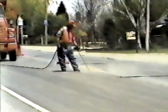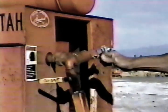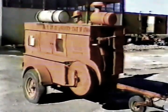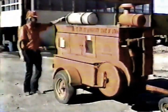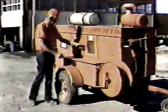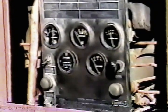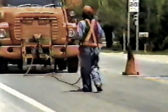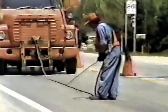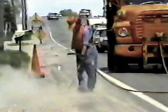That's basically all that's involved in operation. When you're done with the unit at the end of the day, close the air valves and let the engine idle for a few minutes to cool down gradually. Walk around the unit one more time — look for any leaks or signs of damage. Anything you can take care of now will save you time the next time you use the compressor. After the cool-down period, shut off the engine. You'll probably operate equipment that's a lot more complicated than the air compressor during your career, but the same equation will always apply: thorough daily maintenance plus careful operation equals a skilled and responsible operator.